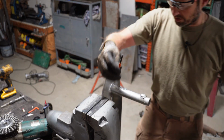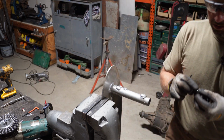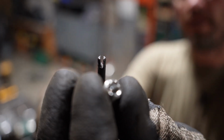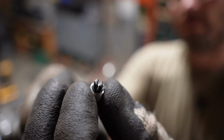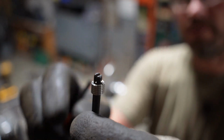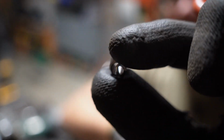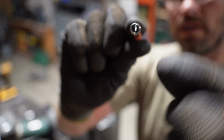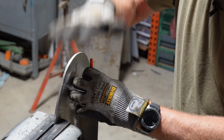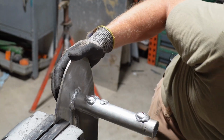And we've got a tang break-off tool, if you've never used one of these. So this is your helicoil install tool, and there's a little tang on the bottom end, and that's how you drive it in. And because it's like a spring, as you're spinning it in, it keeps loosening the spring until it's all the way in. Once it's seated, you still have that little tang there in the bottom. So you take your tang punch tool, throw it in there, give it a good pop with your hand, and it'll bust that tang right off. Bust our tangs off. Like so.